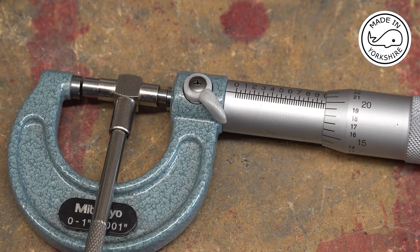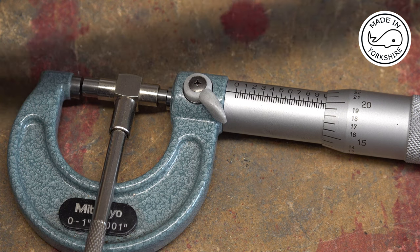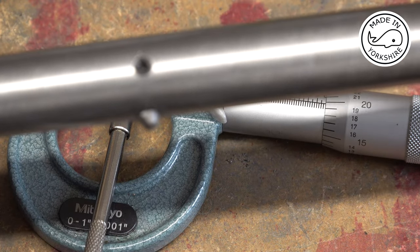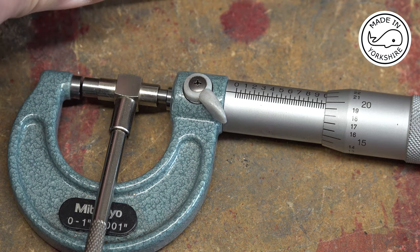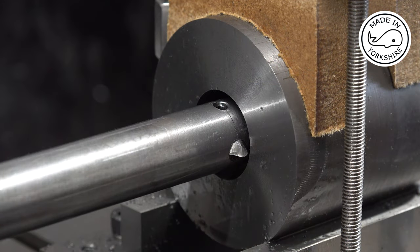So currently we're at 0.995 of an inch in diameter, and the drawing suggests getting it to 0.999 of an inch and then hone it. But I'm going to change it slightly. I'm going to go for 1 inch spot on, then hone it probably to 1.002 of an inch, because I think I'm going to use a Viton O-ring as opposed to cast iron rings. That's my plan. So what I need to do is adjust the boring bar again, and move that cutter out by 2.5 thou. So hopefully this should be the final cut.